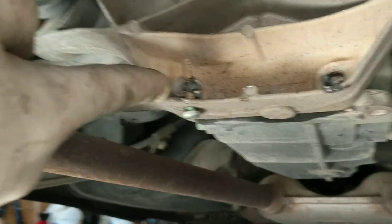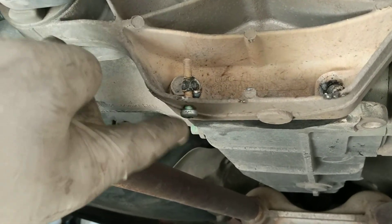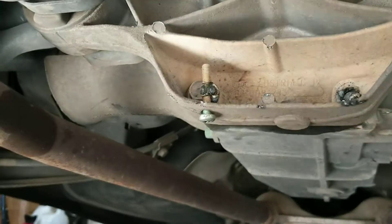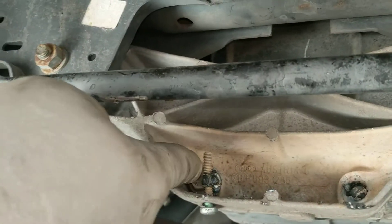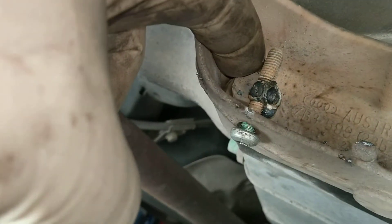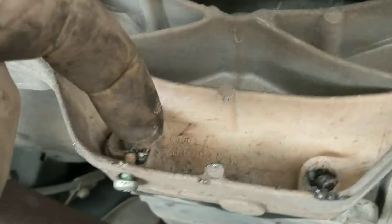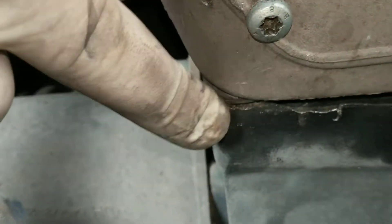On this side, I was able to drill a little bit into the bolt, but the drill deflects into the soft aluminum housing, so I was only able to drill maybe a quarter inch. But that gave me enough of a bite to put a bolt through, then I drilled a hole into the bracket and welded another bolt so that the guide bolt doesn't back out and doesn't fall out — that should hold it in place right over there.